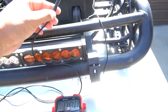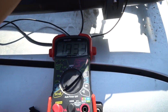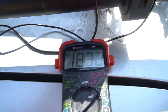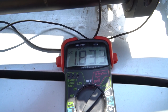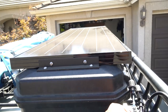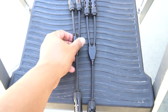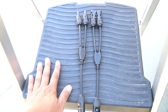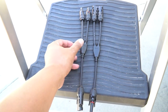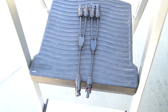Alright, we're going to go ahead and take a reading — it's about 1 o'clock right now. I'm going to show you guys that it generates about 1.8 amps right now, which is kind of low for a 70 watt panel. But this is the only panel I could find that would fit up here. I also got these Y adapters so that I can use both my solar panels if I really wanted to. They basically wire the solar panels in parallel — you plug both panels in and it comes out to one connection.